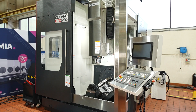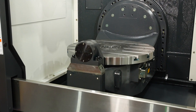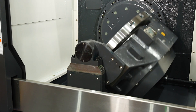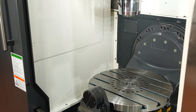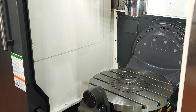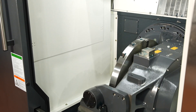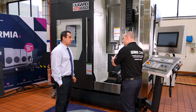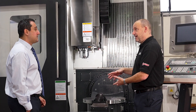The GTX 650 is the latest addition to our 5-axis range. As you can see, it's a very capable machine. It has 650mm swing on the table and as you can see the table is supported on both sides, which makes it very rigid and it can take up to 300 kilogram weight. Now we see the table moving here, doing its tipping action — 300 kilos on that table, tipping to its full-degree position and still machining.